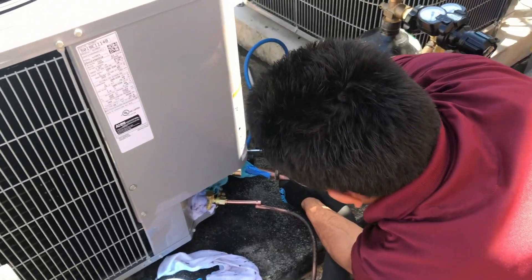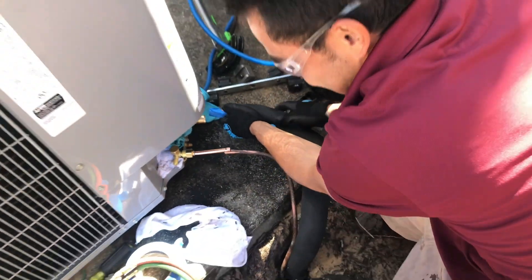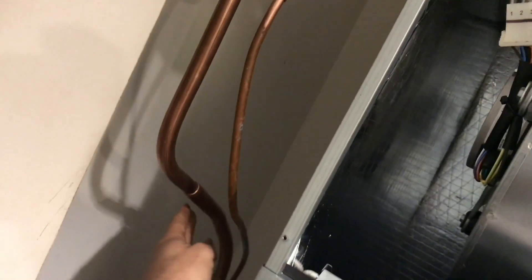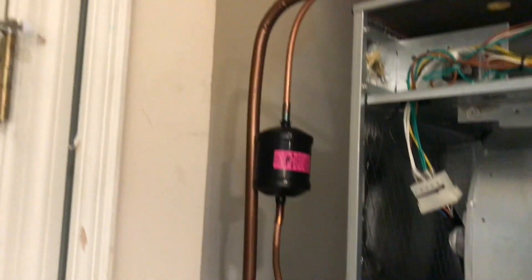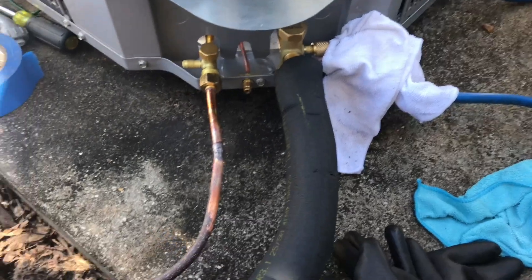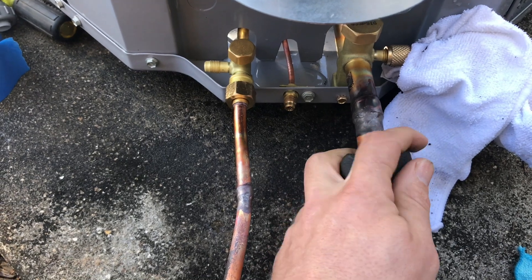It's all hooked up. So now we can just feed into one side and it'll flow through all the way out to here. So we have coming up from the chase — we're flowing right now into our suction and it's going to go through the coil, then from the coil out through this TXV, flow through the TXV out through the liquid line. So all of your joints are currently being passed through, and then it goes down to the condenser and dumps out that open port where we have the Schrader removed on the liquid line. We're ready to braze — right about 4 CFH, cubic feet per hour. The air handler is currently being brazed in while it's flowing through and out right here on this side. All of our oxygen is out of the lines, and we won't have any oxidization buildup inside our line.